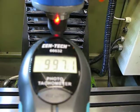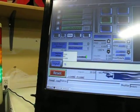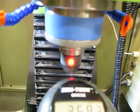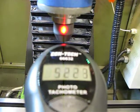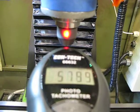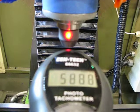Let me show you what it sounds like at 6000 RPM. I'll do a speed request - S6000. I've noticed that the higher the speed you request, the longer it takes to come up to that speed. At the higher speeds it takes a while to get there, but it does get there eventually. Even though it's like 5800 right now, it'll eventually creep up to 6000 RPM, but it literally takes about a minute to get all the way up to speed.